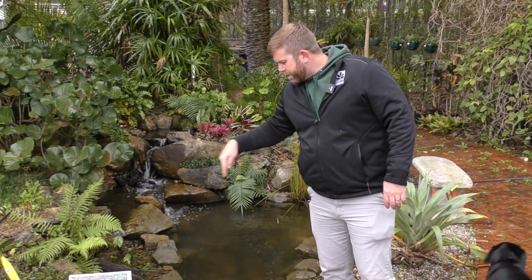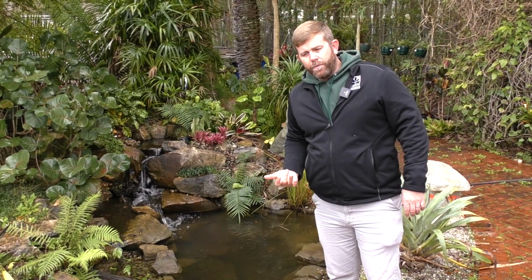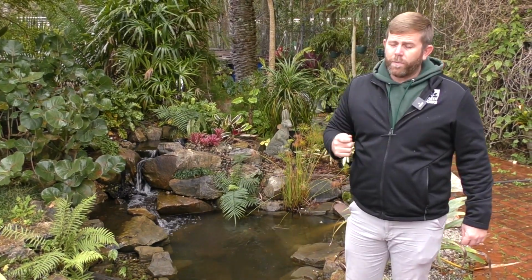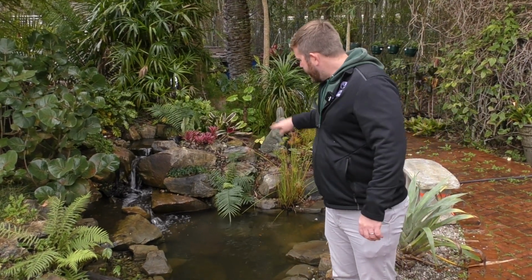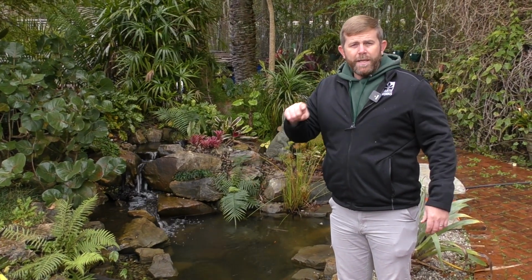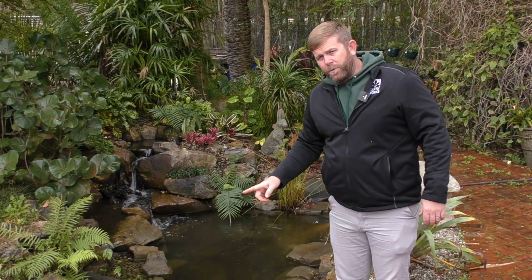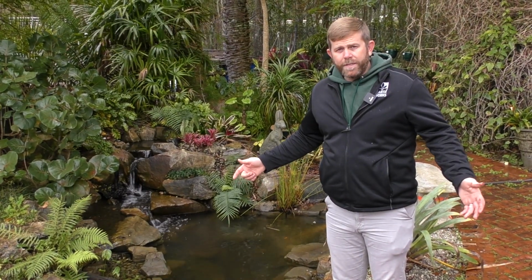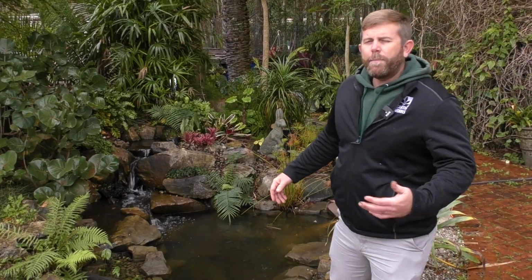You can dig a hole on both sides of the skimmer to reach your hand through and under to feel if you have any water coming through there. And that has happened every once in a while. And this is why we recommend, if you guys are watching this video, whenever you do a clean out and drain the whole thing, you should just reseal that skimmer just for safety purposes, right? It's a silicone beaded seal, and sometimes a plant root can penetrate in between there, and it's totally fixable and very easy to do, but you have to drain the water. So I would do that usually when you're doing a clean out and be preventative about it.